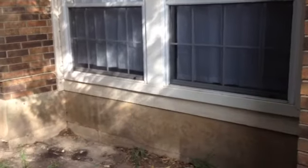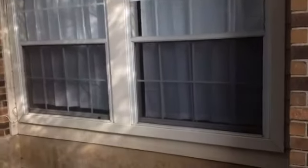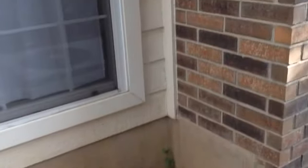So these windows here, again, the siding, and the siding up on that front-facing wall. On this side and this wall, it's all the Colonial Rough Sawn. However, this trim down below is Hardie. The half-round trim is not. So basically from here up, Hardie trim, everything else we'll leave, we'll caulk and seal and paint. So that's pretty much our scope of work here. This interior corner trim right there, that needs to become Hardie. You can see it's already rotten. And same thing with that 1x4 run right up there.